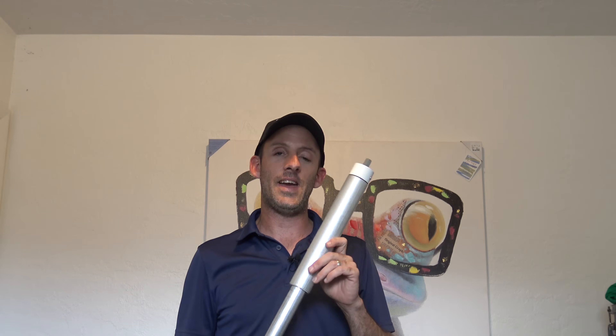Sometimes we have to compromise, but I'd rather have a resonant compromised antenna than a compromised antenna that's nowhere near the band I want and then load it up with a tuner and expect good results. It's hard enough to work 80 and 40 meters mobile with an uncompromised antenna — it's just as hard or harder with a compromised one. The lower the band mobile, the harder it is.